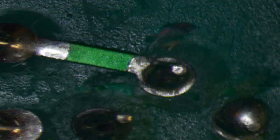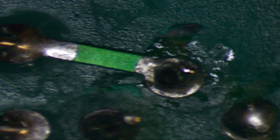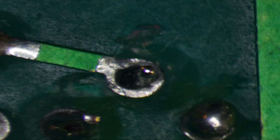So removing the solder from the lead results in this, and as you can see there's just corrosion and dirt and muck down in the hole, and that again will cause intermittent operation. This is a current driven system, so resistive connections do cause a big problem. And so what I do is clean the hole out with a bit of IPA, so it looks like this, and then I resolder it and clean all the flux off, and we end up with this.